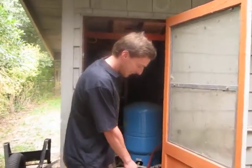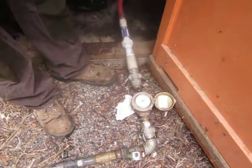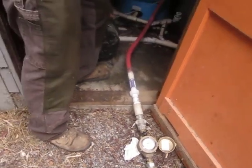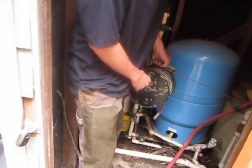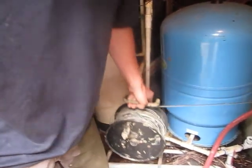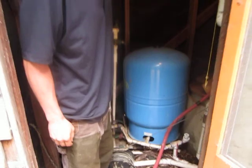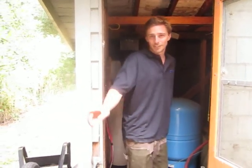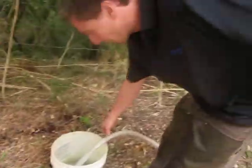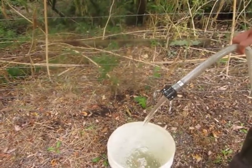If you take a look here, this is the water meter representing how many gallons we're pumping from the well at any given minute. That's measuring the rate at which we pump the well. This device is a sensor that goes down the well to determine the water level. The idea of a two-hour test is to draw the water level down, stabilize the pumping rate so that we can determine the rate at which the well is recharging. Over here is the discharge from the well, and this is where we can monitor the clarity of the water, whether or not the well is discharging sand.